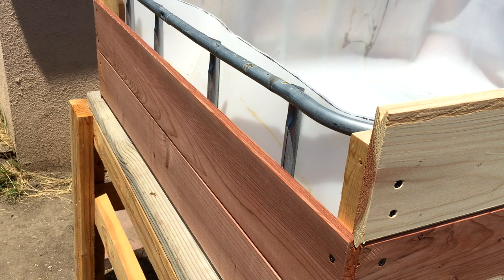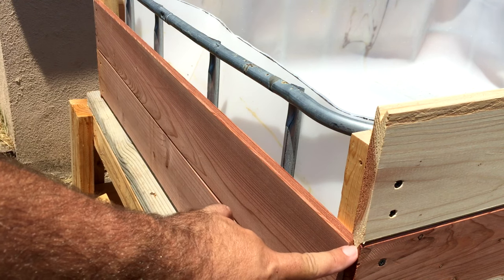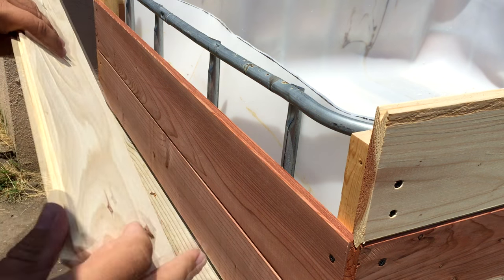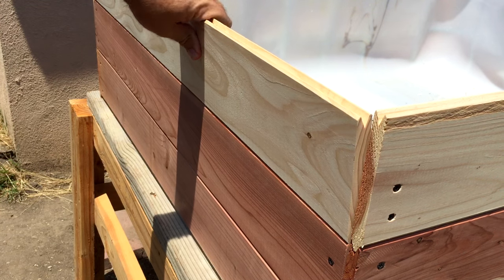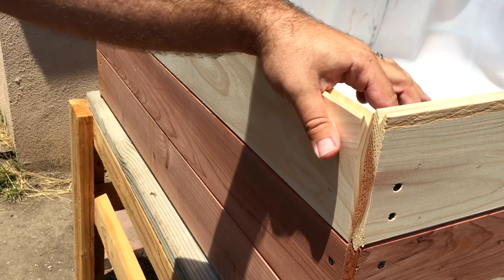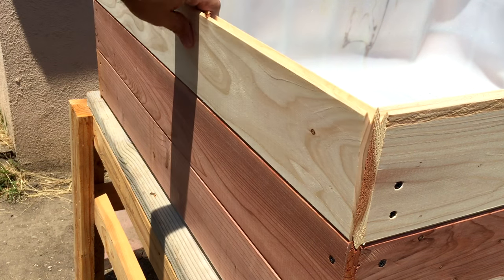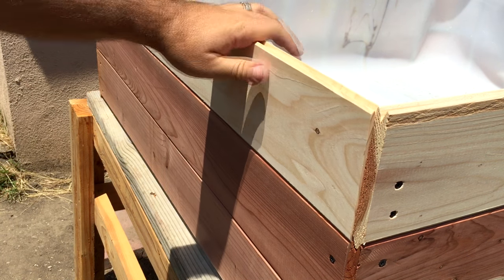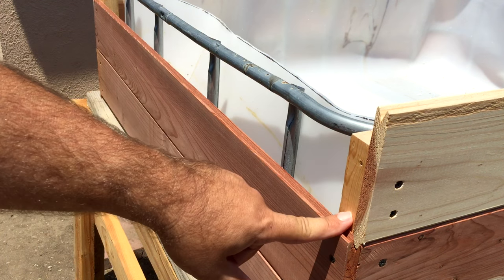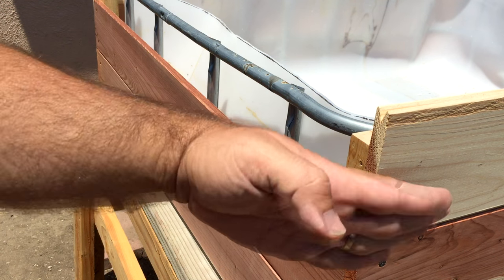Now as you can see on these boards, there is a little V cut out of this right here, and then the other half is a notched-out V that will fit into this one. I already basically ripped all these to where I can fit them pretty easily — they go right down in there. There's a board in here, it's a one-and-a-half by one-and-a-half. You want to make sure you pre-drill your holes. I just wanted to show you how these fit in there — you can actually hammer this down a little bit and it will stay in there pretty good. Then they drill into here. Basically this allows that V thing with the other V going in there, making it so sunshine can't come in through the sides.